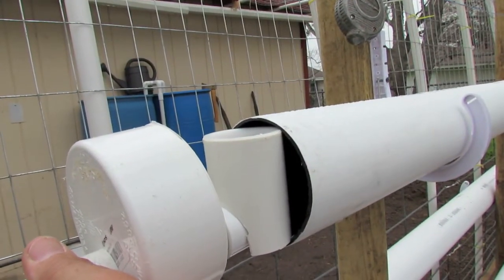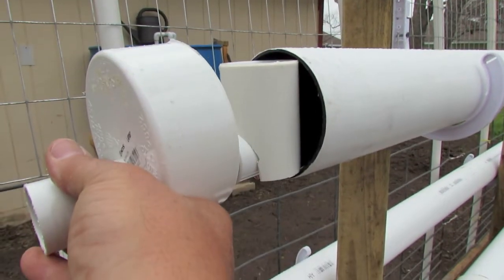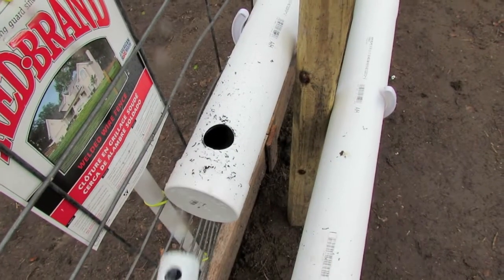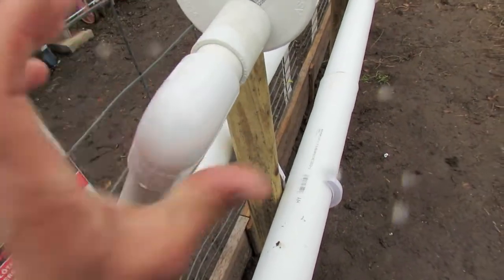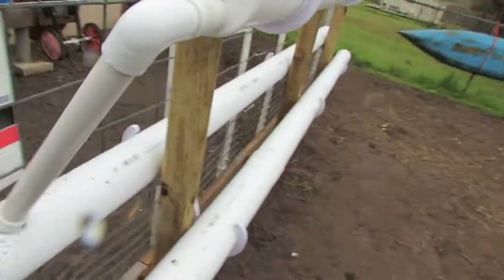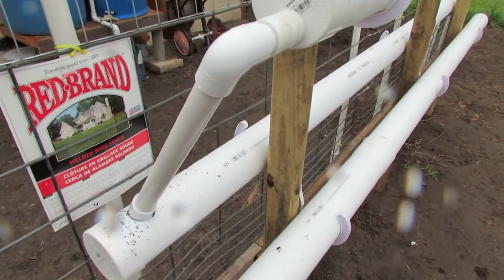That's a little tighter fit than what it should be but it still works. The important item is how tall that stand pipe is inside the larger drain pipe. The drain goes down into the next level and basically the same thing happens on the other end, and then on the other end — the very bottom one — it goes into the receiving tank, but I haven't built that part yet. I'm still testing the siphons.